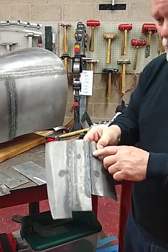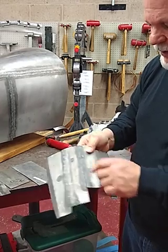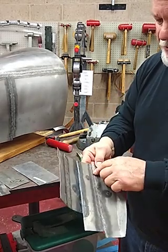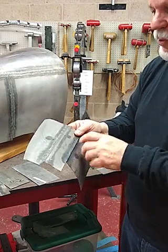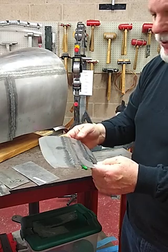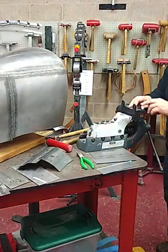You can see here what that joint looks like when it's welded — this is a lipped edge that has been gas welded. This one has been mildly planished and this one a little bit more. We can see from the back the penetration or the underside of the lips. In this case, multiple joints created a volumetric shape — which could have been raised or created through a series of joining processes using different shaped panels or even flat panels.